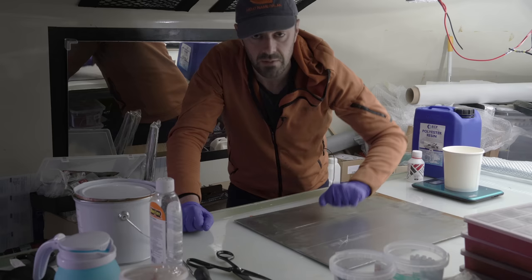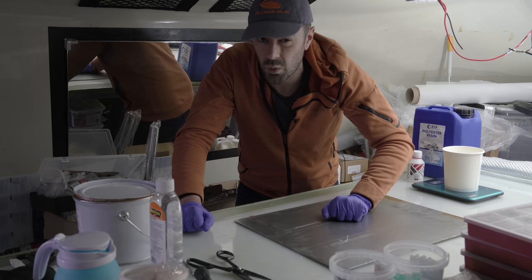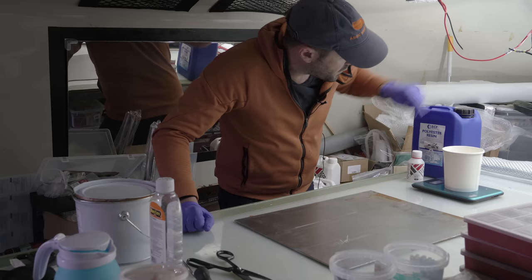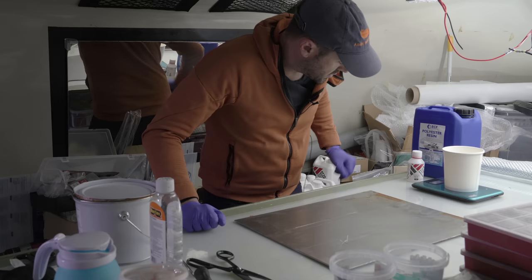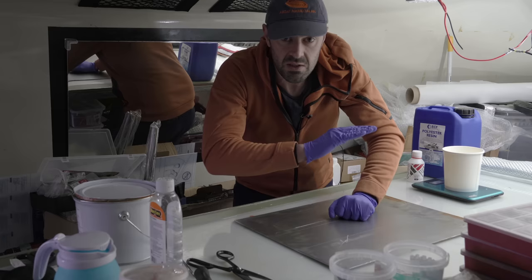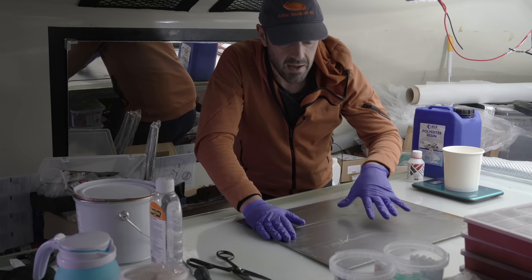And this time, instead of just going for quite thin stainless steel which wouldn't take much of a thwack, we've gone with much thicker mild steel, and I'm going to give it a really good beefing up with some glass fibre. The glass fibre is going to be a combination of thick roving so we can get some thickness going nice and cheaply, then some chop strand mat over the outside to try and smooth off the texture, and then finally a very, very thin layer of what's known as surface tissue, which is a very fine chop strand mat that means you will have less sanding and mucking around afterwards to try and get a smooth surface. I've never used surface tissue before, but there's always a first time for everything.